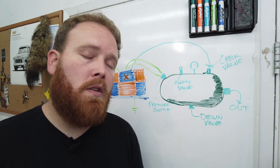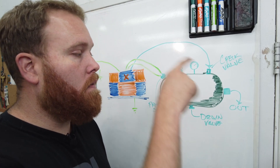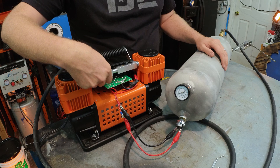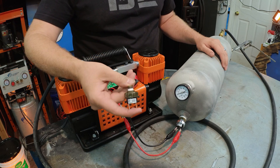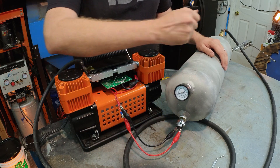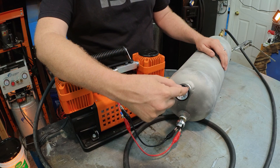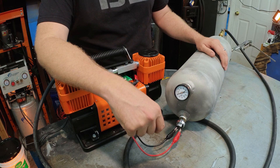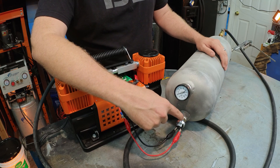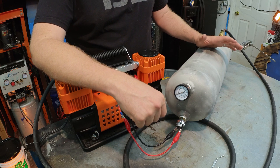Let's go back to the workbench and I'll show you in person what this looks like and how all these pieces fit on one tank. This was my pressure switch from the compressor before — it was 90 to 120 on and off, but that proved too high because the compressor would not pump the tank up to 120 psi; it would stall out. So I bought a 70/100 switch — it turns off at 100 and turns back on at 70. This works absolutely flawlessly.